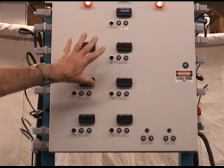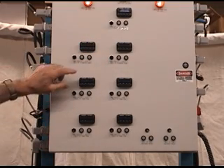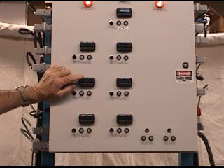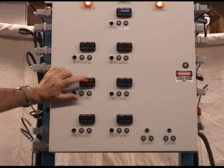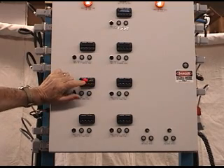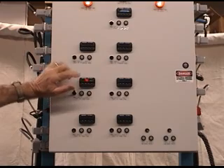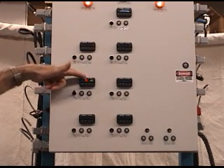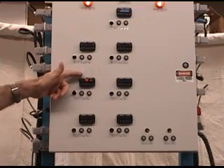In this system, we have seven different heat zones. Each one is comprised of a proportional controller, a thermocouple, and a heater in the zone. When the operator sets the desired temperature, the actual temperature is displayed. As the actual temperature approaches the set point, the current is reduced so we try not to overheat the zone. That's proportional heating.